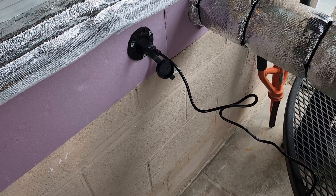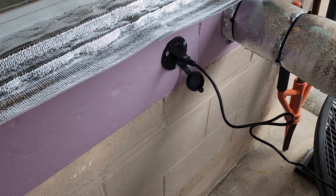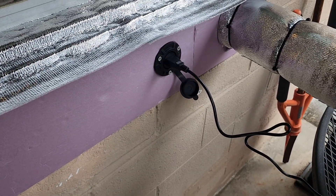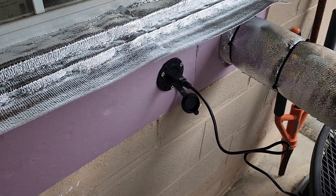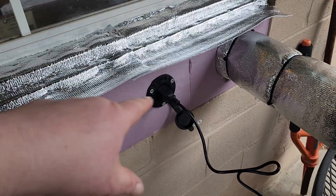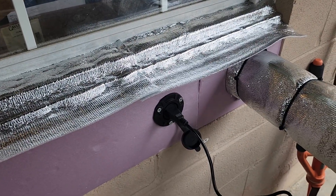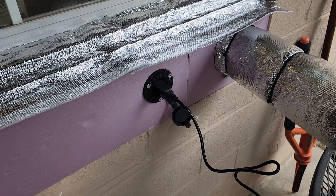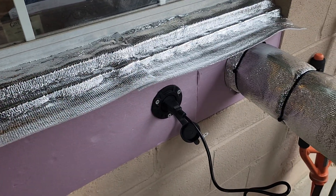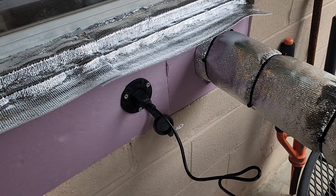On the inside I'm going to plug this into the UPS power station — it's just a power station that has a UPS function. If yours has that uninterrupted power supply feature, you can prevent your diesel heater from frying itself by providing constant power. Another benefit: in summer I can plug my electric pressure washer right into that outlet. I could also run a battery charger out here to charge my lithium iron phosphate battery, or put a three-way splitter on and run the diesel heater and charge the battery at the same time. These outlets are under $20.